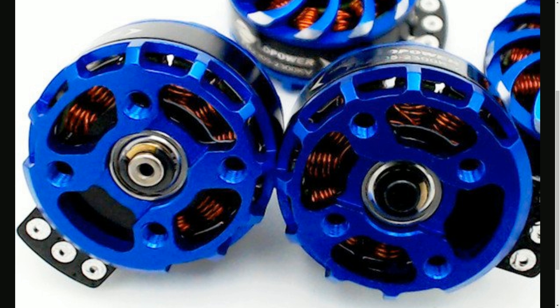Another cool feature is that these motors provided protection to keep the screws from touching the windings. There's a common mistake people make of using screws that are too long — the screw goes up and contacts the windings, the motor gets super hot, and it can damage the motor or your battery. LD Power has put — you can kind of see it right here — a protective piece of material, I think it's a circuit board, under the screw holes so that if your screw is a little bit too long it will not make electrical contact with the winding. That's a really nice touch.